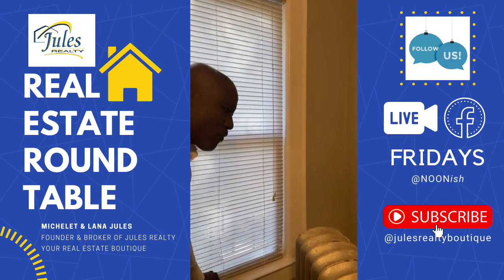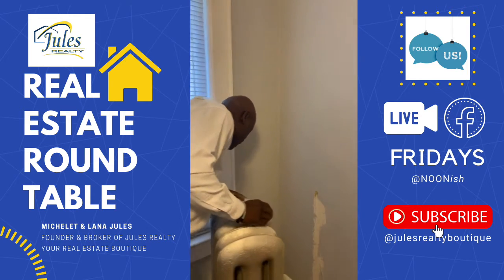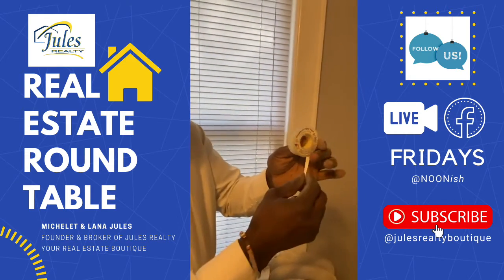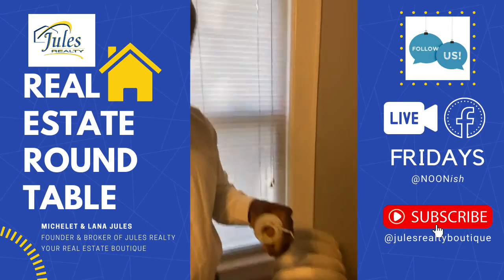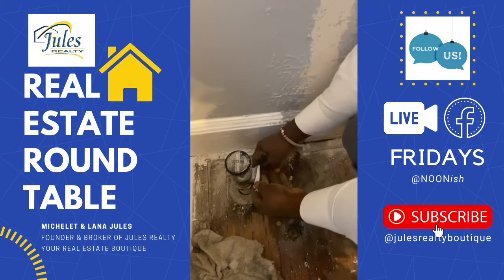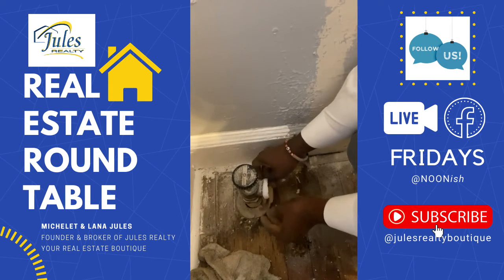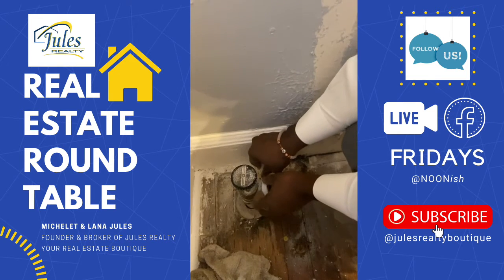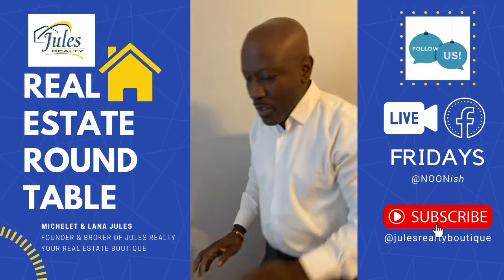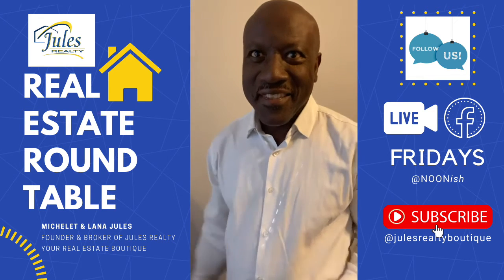I'm going to give you tips for putting it back. Once you remove this radiator, I would recommend that you put a little Teflon tape. You just take the Teflon tape — they're pretty cheap — and you wrap it around the edge of the pipe fitting like this. That definitely helps seal your radiator from leaking. Once you finish with this, you just walk it back in place again. Don't walk it with your back — walk it with your legs. Pretty much that's my tips for today.